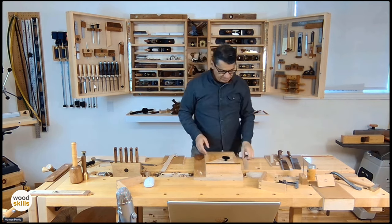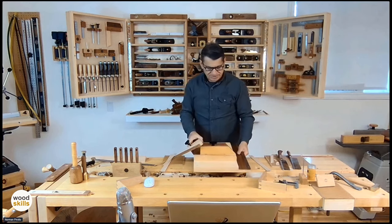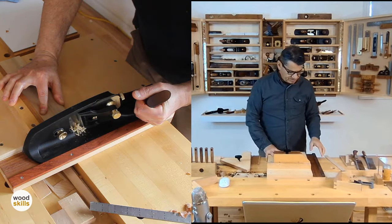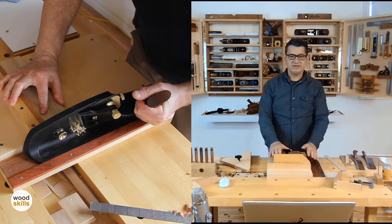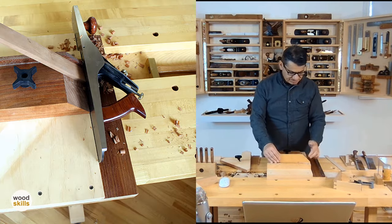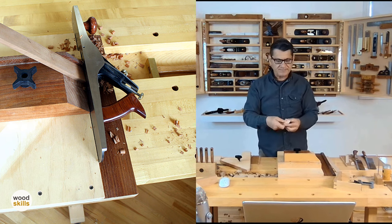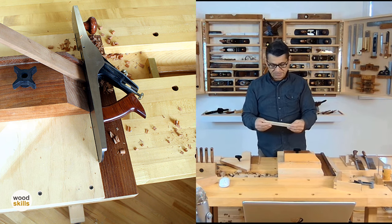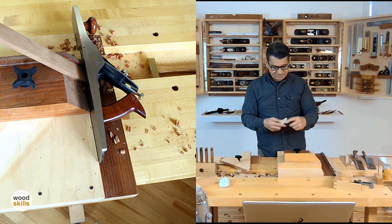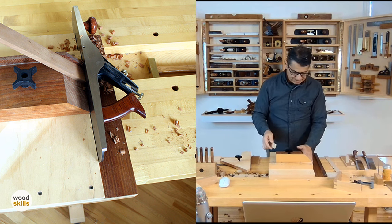This is my most recent go-to shooting board. This is actually one of the original left-hand orientation shooting boards I created for that Fine Woodworking article, way back when. This attachment does case miters — here's an example of a case miter. This is 45 degrees, so this would apply to a small compartment, a box, or a drawer. It's important to have the corners at 45 degrees, and that's accomplished through this attachment.